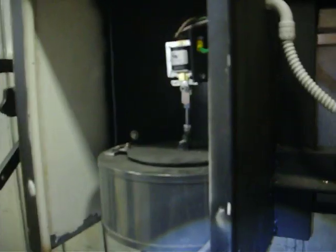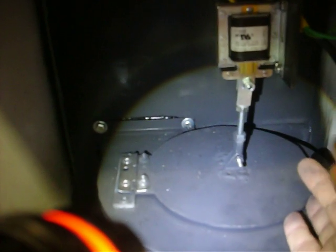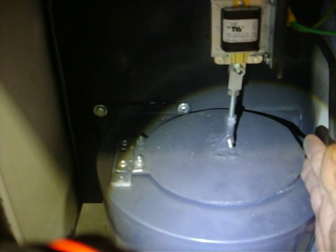This door inside houses a blower motor and an electrically-operated solenoid valve — it just comes off like that. There's a steel plate on top of the blower motor, which is a little larger than I needed but it's what I had. There's a hinge here that attaches, and when it calls for air this lifts up — about an eighth-inch gap right now, adjustable via a threaded rod. The idea is it calls for air as needed, and if we lose power or anything happens it shuts right down and won't destroy anything.